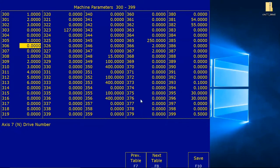Configure the encoder assignment. Just like in the previous step, the CNC11 software needs to be configured to know where each encoder of the All-in-One DC is. Unlike the previous step, the All-in-One DC does not use drive bus to allow the encoder to communicate. Instead, the All-in-One DC uses the onboard MPU11 encoder channels via parameters 308 to 315.